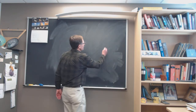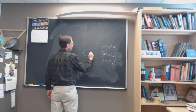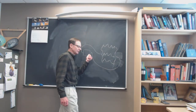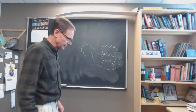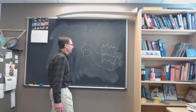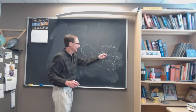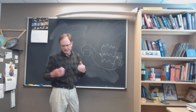You'll have your resistor network out there, hook your battery up to it, provide the current, and measure the current through the circuit. If you treat this as a 1.5 volt battery, you'll check to see what the effective resistance is of the entire circuit. You'll see what happens to the potential drop across the resistors as you change what the resistors are — as you change the load.